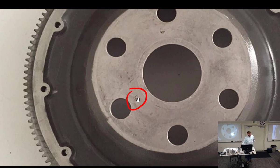When the propeller flange bushings are installed in the prop flange of the Lycoming, they're supposed to be different sizes. There should be 5 of one and one that's different. It's called the indexing one. And that O represents where it's supposed to go. On the Lycoming you're installing on your test stand, the bushings were just thrown in there. We don't have enough of the right ones to set it up correctly.